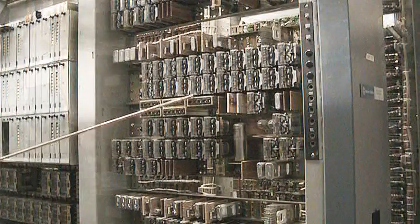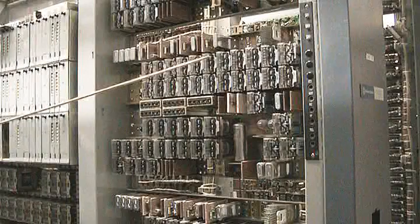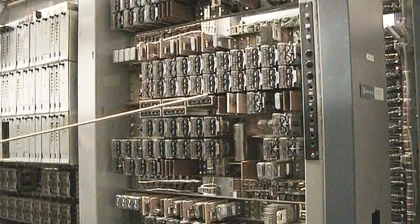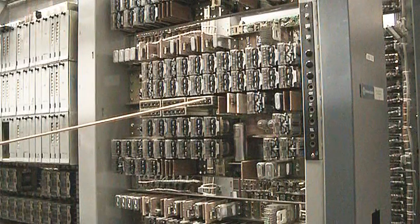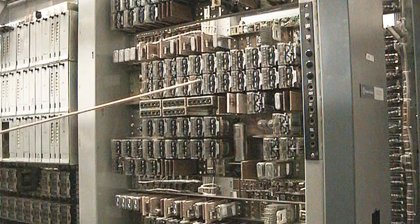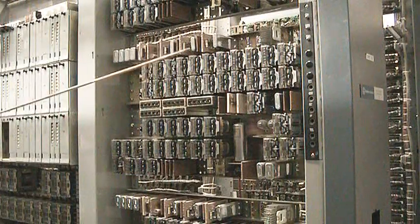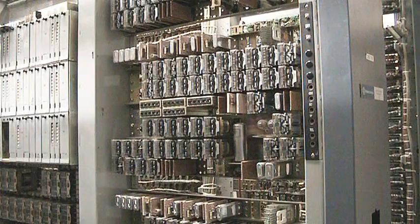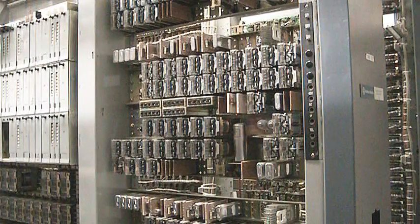This is the incoming register. A normal number 5 crossbar would have a larger incoming register, which would have more relays for digits incoming, because in a number 5 crossbar you would have up to 10,000 telephone numbers. The number 3 crossbar system, since it's only got up to 1,200 numbers, we're only using a very small percentage of a prefix. So this was designed to be a 5-digit or a 4-digit register for incoming calls. Now this register has the ability to receive dial pulse, or wired in conjunction with it is a multi-frequency receiver. On an incoming call, it is only going to look for 4 to 5 digits. If I was in my step-by-step system calling into this, then of course I would be sending 4 digits.